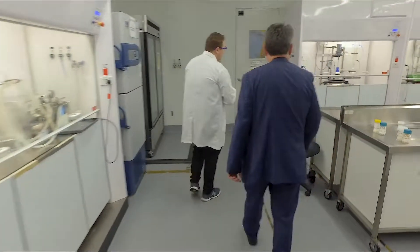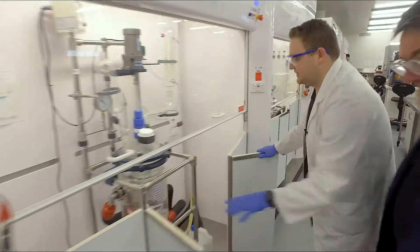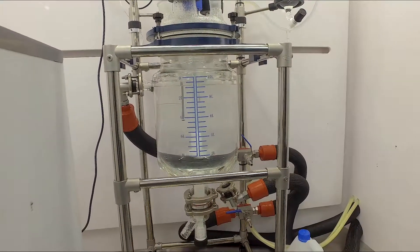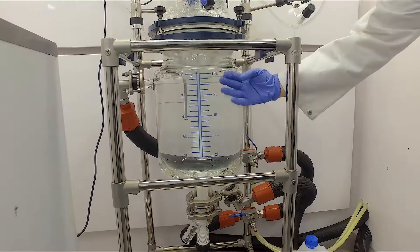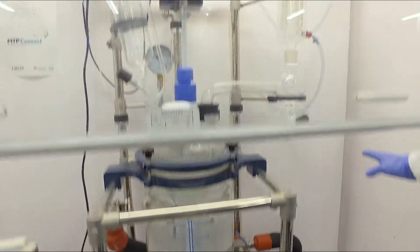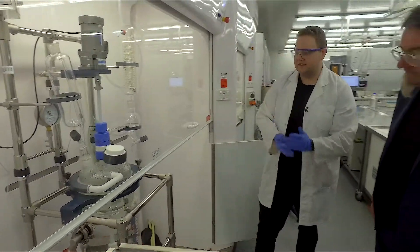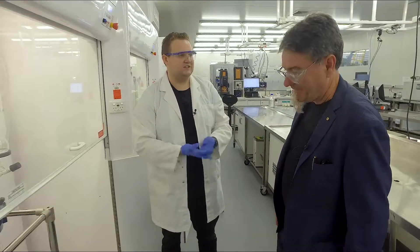These reactors are state-of-the-art. This is a 10-liter reactor, capable of generating quantities of up to 500 grams. All of this is controlled by a thermoregulation unit which is plumbed through the external walls. We can control the temperature extremely sensitively. We can collect our material from the bottom, which means everything remains extremely consistent when comparing it from the small scale to this larger scale.